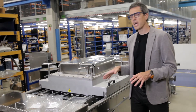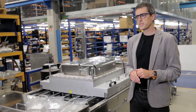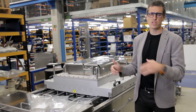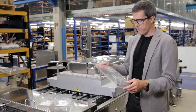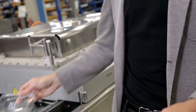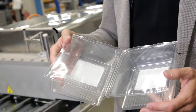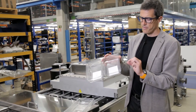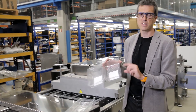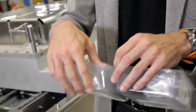In this particular machine we have two different formats: one that is 4x4 units and the other that is 4x2 — so 4 across and 2 in advance. In this case we have the deeper pack with 500g and 1 kilo product, and the other that is 4x4 with an option to make also a v-pack unit where we can pack volumes of 150 to 500 with no option to separate individually.